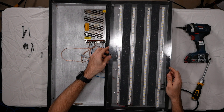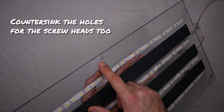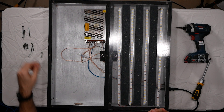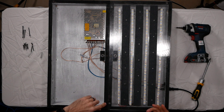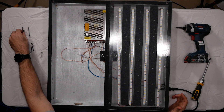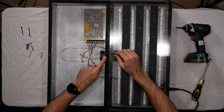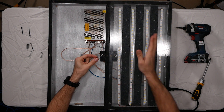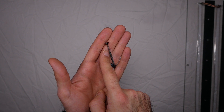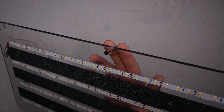So I'll switch it off and discharge, then flip this over — I already have my holes all pre-drilled in here. All three of these in the center I used counterbores for, so I do have to use longer screws since I don't have the material there. If I did it again, I wouldn't counterbore those — I'd just use short screws. For these holes over here, I'm going to use short screws, and longer screws on the ends. But I'll be using a special screw for this one — just a normal long drywall screw, but I ground the threads off near the head, because as the panel slides up and down, I don't want it getting stuck in a down position and keeping the light on.